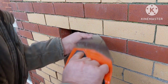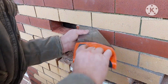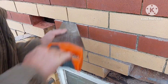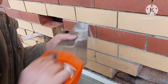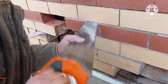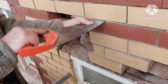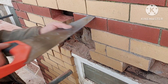In this next section of film you can see me using an old wood saw. This is a method that my father taught me many years ago whilst removing internal walls. You'd knock a couple of bricks out, put your props in and then start sawing away. The reasoning behind it is you're not thumping at the wall with a big hammer and putting lots of vibration and shockwaves through the wall. By doing that you can weaken the structure and basically end up with a collapse. It's hard work, don't get me wrong, but it's a great method. You can do it with internal or external brickwork, providing it's constructed with lime mortar.